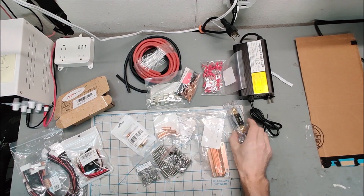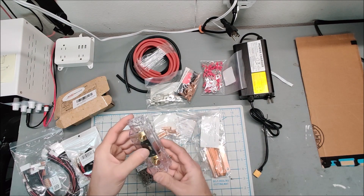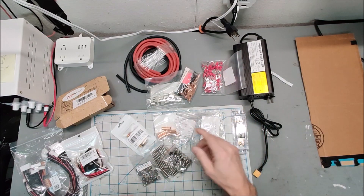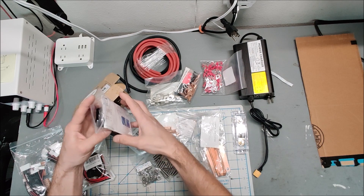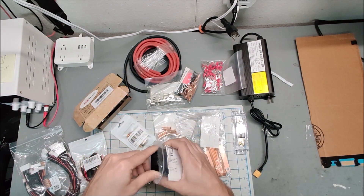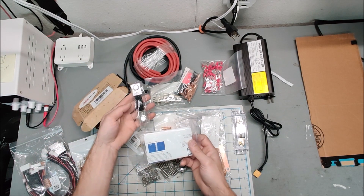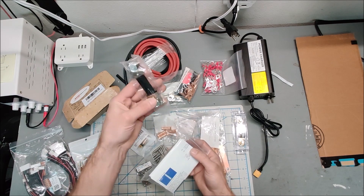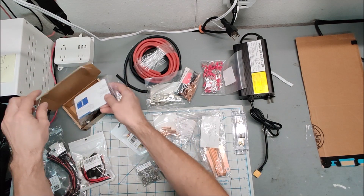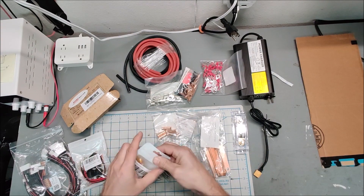I've got a two-pack of fuses — one is already mounted on the back of the case — for the main fuse just to be safe. I also have a power meter, the same one I use in my lithium-ion power wall. It has a 100 amp shunt that will go on the back of the case after the fuse so I can take measurements of incoming solar and outgoing inverter charge.